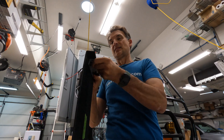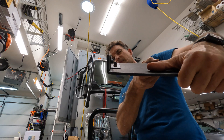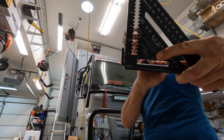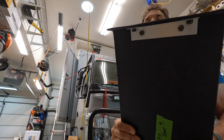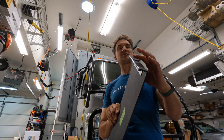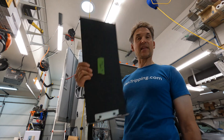I can get these even tighter to make sure I have a good solid connection. You can see there's just an ever-so-slight angle remaining, and a little bit of waviness in the middle where there isn't a screw — you can see it pulling away ever so slightly. Totally fine for my application. That goes to show this HDPE will probably pull out a little bit with this home DIY bending using just a heat gun on the edge, instead of a proper heated 90-degree flat bar. But a little bit of aluminum angle looks like it'll work to hold this in.